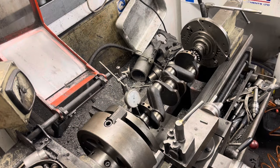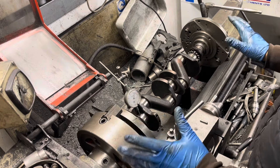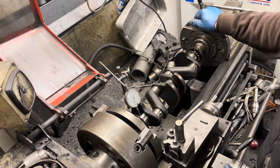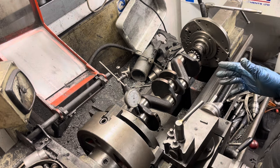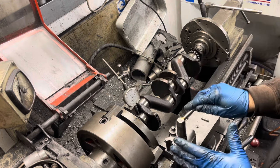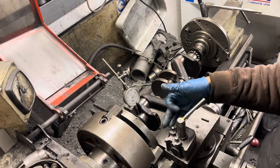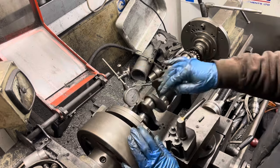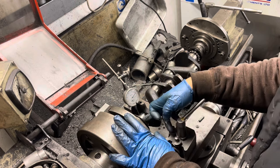Right, you'll have to bear with me a bit because I'm on a bit of a learning curve. I've put the assembly with the special Ian Carter offset tool in the four-jaw chuck and in the revolving centre — tailstock locked up, everything set. I was trying to think how Ian would have gone about this, because it's my first time. I imagine the first thing he'd do is to clock the rear main up with it set, with some zero dowel holes. I put the dowel pin in on the zero and clocked it up, so this is now true to the rear main.